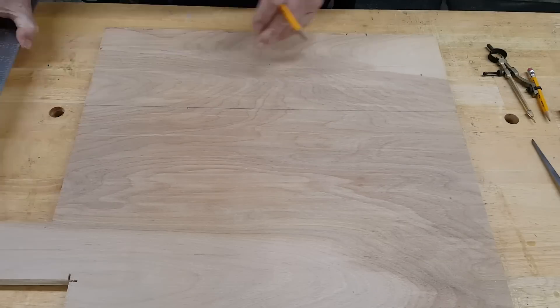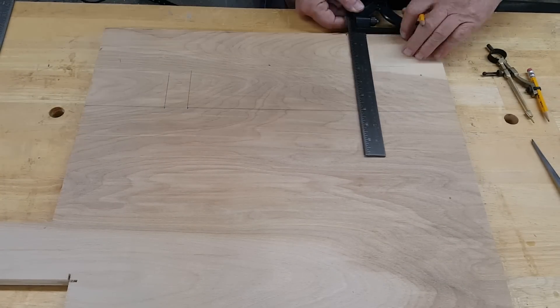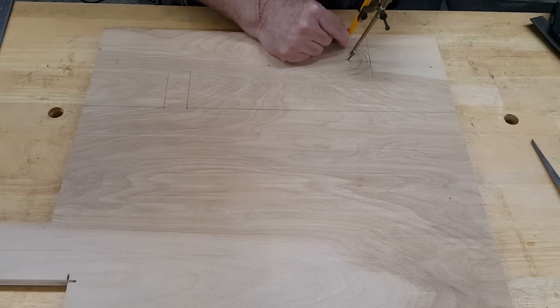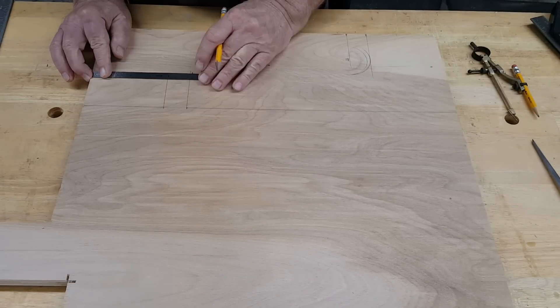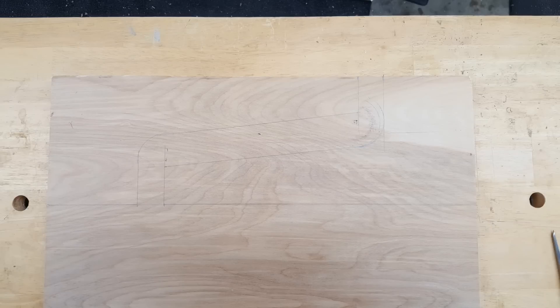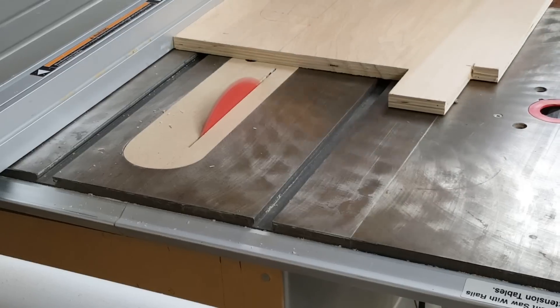The arm is made of a double thickness of three quarter inch Baltic birch plywood, six inches by fourteen inches, with a section cut out from the bottom and curving around to taper upward to the right side. The curve is formed by a two inch circle centered at two and three thirty-seconds from the bottom and five inches from the left. A straight line is cut up from the bottom to the left edge of this circle and then around it, from the top of the circle it tapers to meet the right edge at one and three quarters from the top.